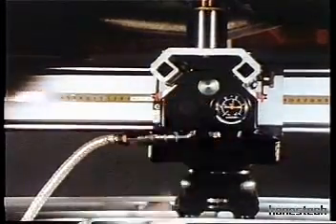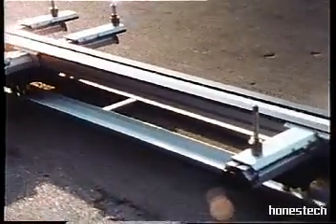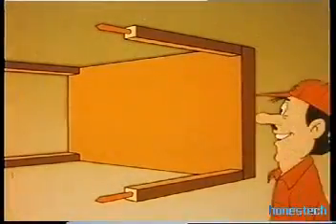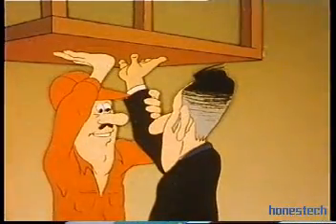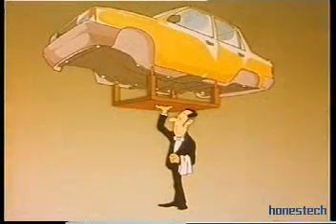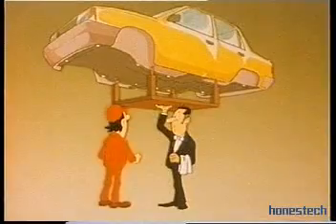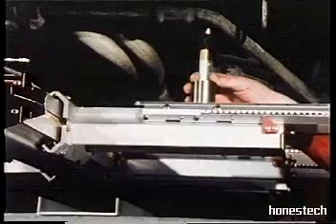How has such a complex process become so simple, so fast and so precise? The measuring unit can be compared to a high precision engineer's table — but a special table with adjustable legs pointing up into the air. The table is supported by a flexible device: the air bellows, which holds against the specific manufacturer's points. Having located the table, we can now add as many legs as we like — in this case, two more, making six. The measuring unit, however, is not just a diagnostic tool.